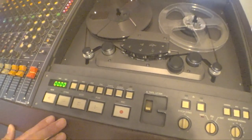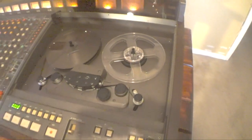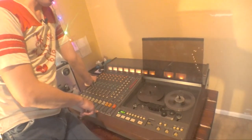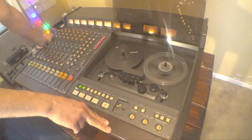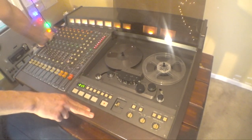You always want to have a little bit of tape wound up onto the reel — a good 30 to 45 seconds — because that tape is going to be the least sonically friendly. That's the end of the tape; it's getting handled, getting the edge hit, and will degrade over heavy usage and over time. You can do it the other way if you want those tapes to last a hundred years, but I think the even better way is to digitize those recordings onto your computer, because that'll last a lot longer than analog tape.